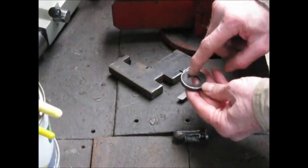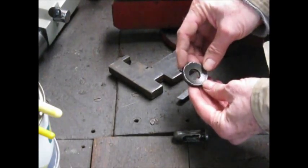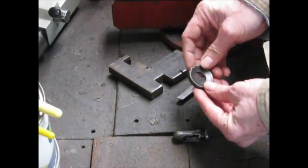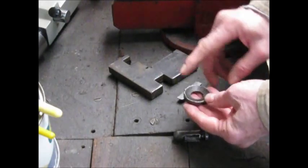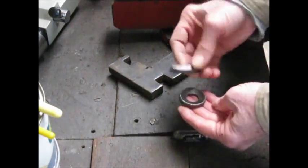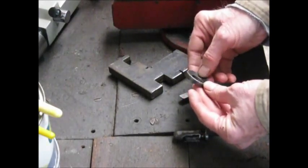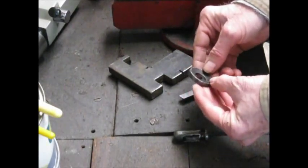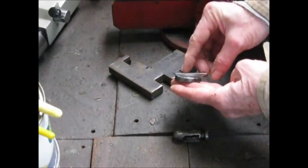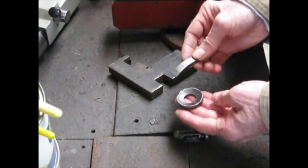The trick is: how do you make a semi-spherical center in the middle of the base? Some of the later ones just have a flat base that the tool piece sits on, but this takes a little rocker. If you try and do it freehand you're going to really struggle to get the correct curvature and the correct angle — that would be very difficult. So the way to do it, get out your tool post grinder and I'll show you how it's done.